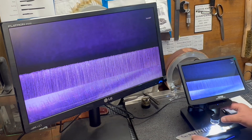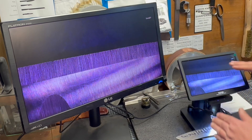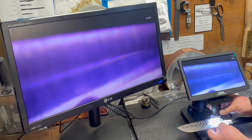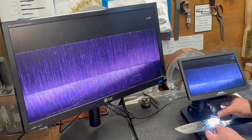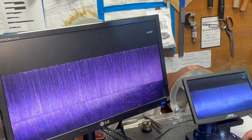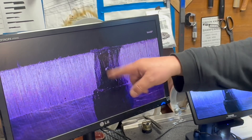I'm going to do a bevel show. The microscope can be raised and lowered - at first I thought the magnification was a bit weak, but as you bring it in closer you can put it right up against the plastic cover and focus right in. You can see the bevel - that's 80 grit right there. You can see the burr - that crackly stuff on top, that's the burr. Now going from 80 grit to 320 - you can see the grinding marks are much finer there than they are here.